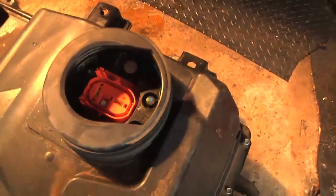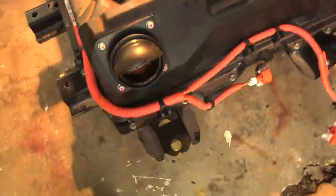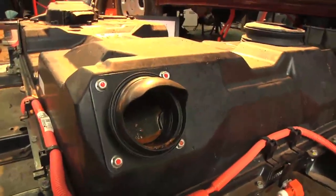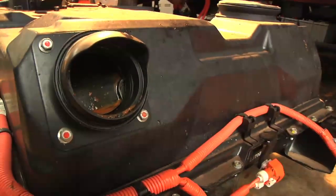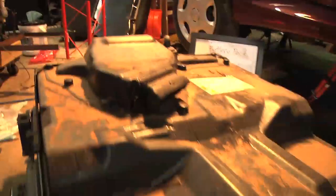That's where you pull the safety plug. It's got a metal cover over it, which is not especially watertight. And I heard about the air cooling in the system — sure enough, it's got a port that goes up kind of into the bodywork of the car. That definitely got all wet. I'm sure this thing's just absolutely full of salt water. On the back here, looks like another air port of some sort — this looks like it's got an air filter on it. And there's a big lithium-ion sticker, and plenty of sediment from the storm.